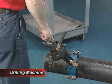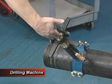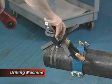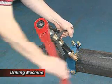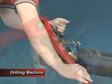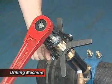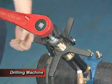Lower the drill bit down until it touches the pipe. Snap the star feed yoke over the shaft, then twist down until the yoke touches the bearing. Attach the ratchet wrench on the square drive and turn the drill clockwise while turning the star feed clockwise to feed the drill. Momentary lack of resistance during the drilling phase happens when the pipe has been cut. Do not attempt to overfeed and force the drill at any time during this process.